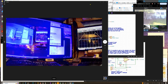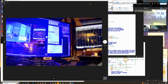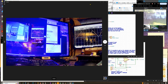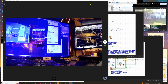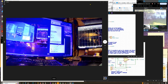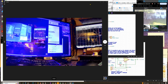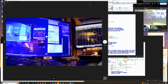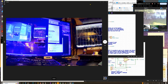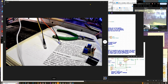That's what you want, a large number in the denominator of that filter formula, 1 over 2 pi RC. The bigger the denominator, the lower the frequency. So that input impedance pushes it up, so it's no longer acting like the badass filter it was with 2 10K resistors effectively in parallel, meaning 5K. So that was a lot smaller, but this works a lot better. I can throw square waves at it, sine waves at it, and even noise, and you can see this thing really go goofy with the noise signal.